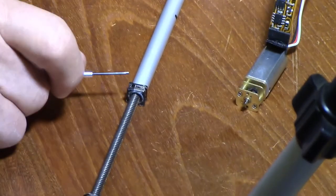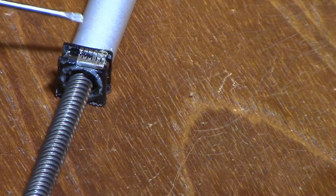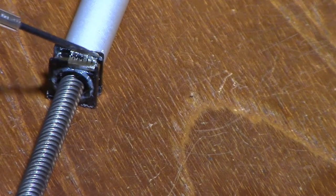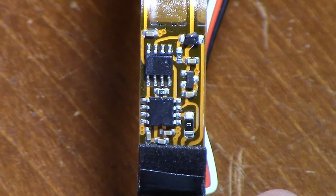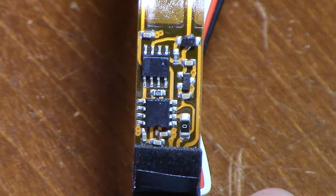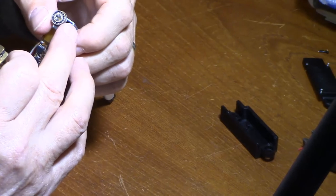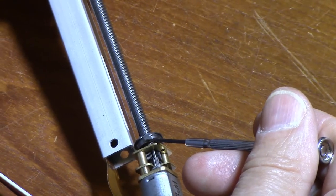is here. Yes. The nut on the lead screw looks as if it's conductive. Just this area here. I don't know whether it's threaded within the hole. Shouldn't think so. No. There might be some. So that conductive surface on that nut is sliding on the graphite, is it? Yes, that's correct. So that's to make the linear potentiometer. Yeah. So that's the circuit in its entirety. Sort of good. But I was just wondering what holds the outside of the ball bearing. Now the outer edge has got a flat on it on one side.